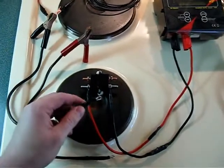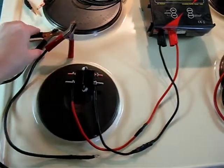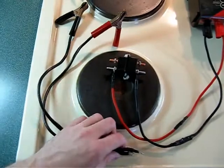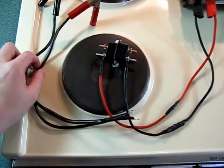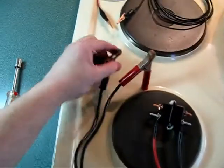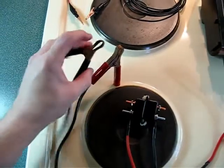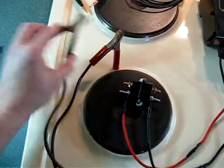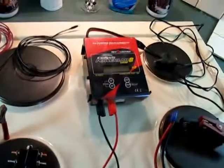What I normally do when charging or discharging my CALB cells is use these alligator clips — big ones — with a fairly beefy cord that came from a battery charger that died a long time ago. I just take these little eye-terminals, put them on positive to positive, negative to negative, and charge the cell. The cords don't get too hot and it just works. As you can see there's some carbon scoring on these from when they sparked — during incidents where one fell on a battery terminal farther down in the pack and sent more than 3 volts through there, which blew up my previous PowerLab.